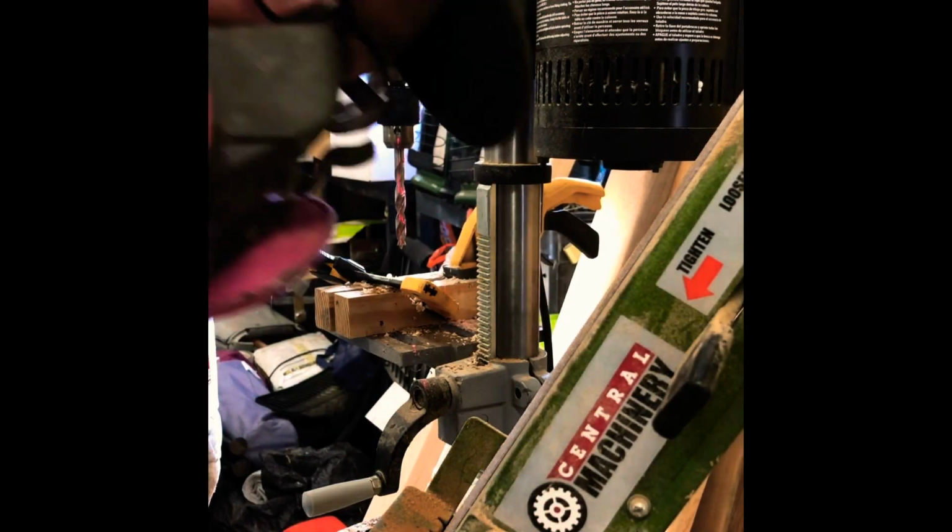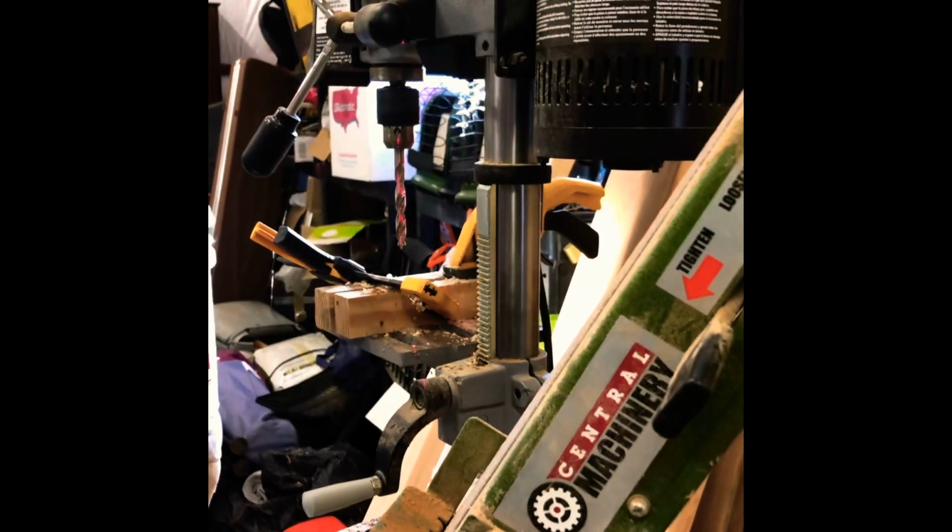Now we're going to do some sanding. Be sure and wear a dust mask, some kind of respirator, something, so you don't inhale this stuff. What I'm doing here is on the bottom of the sander, I'm getting as much material off as I can. And then I'll pick it up and I'll hold it in about the middle to where I can hold it a little bit more level, because it seems to put a bevel on the edge of it at the bottom side. And then you do this on both sides of this blank